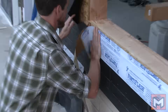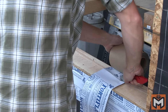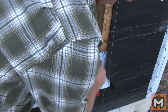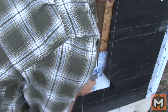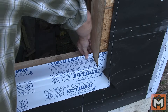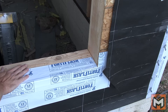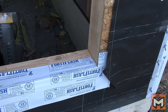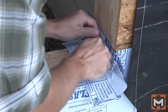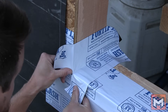In the corners, you want to make sure this first layer gets tucked under the side flaps and secured to the sheeting. Next, I'm cutting another piece of flashing at the same length and overlapping it a few inches on top of the first piece, making sure it too is secured under the side flaps. Then I carefully cut down into the corners and fold the remaining flashing inside the sill. In this case we're working with a 2x6 wall, so it doesn't cover the whole sill — in typical 2x4 framing, it typically would. I cut a small piece of flashing and mount it to the side of the frame and the sill, carefully cutting a slit to secure it down. Make sure you take your time here and don't have any holes or exposed areas where water could trickle in behind your flashing.